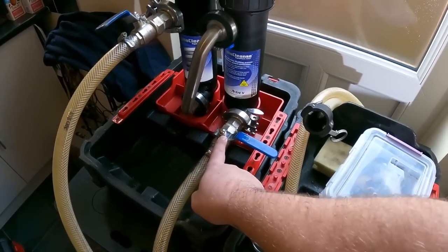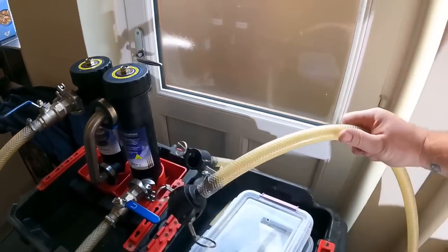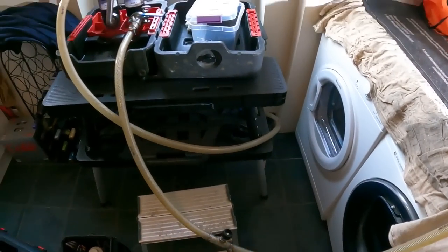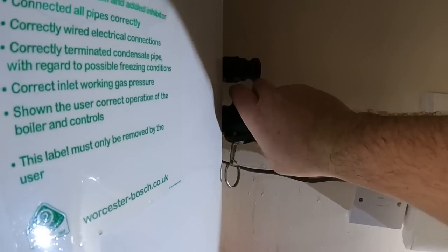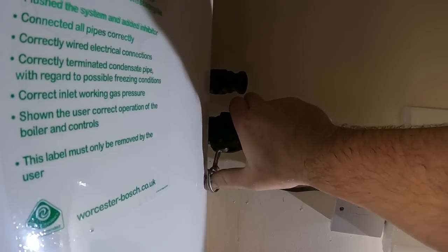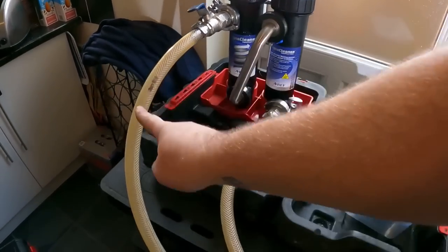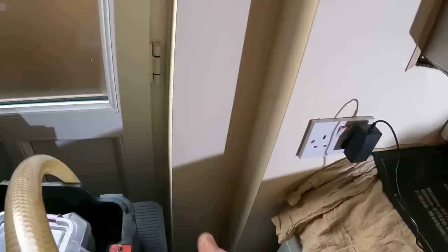So this is the inlet, this is the inlet pipe. So if we trace that back around, it's always the one, or I always do it, with the one with the drain off on. So if we connect it onto this one, this is the return coming back to the boiler. This bottom one is going to be off there, in through the bottom of our MagnaCleanse unit, flush through, and then it'll come out of here into wherever the end of it's gone, into this one. So we'll attach this one